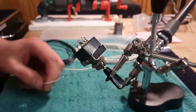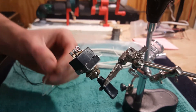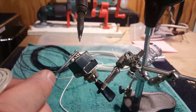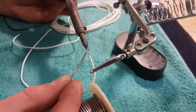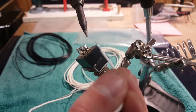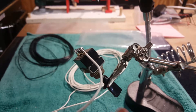This video is really about basic soldering and how to make wiring in a guitar look nice and clean. Going over those steps again: first thing is a hot soldering iron — let it do the work, don't be pressing on it. Tin your sections. Get a little bit of solder on the section you're going to solder, get it good and tinned, and since you've got fresh solder on there it's still kind of warm — it's going to go right in there. There's a nice clean solder joint — that's how you want it done.